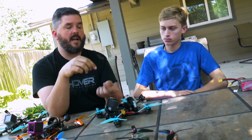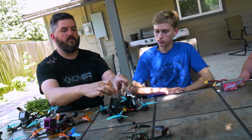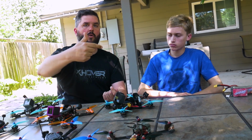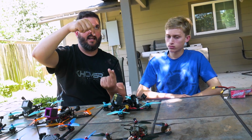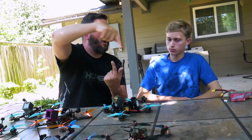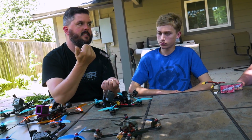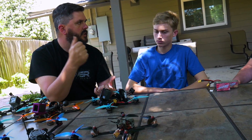So with a True-X, there are so many trade-offs. With a True-X and a top mount battery, now you've elongated it. Or you have a True-X with a bottom mount battery, and both roll and pitch, because everything is centered around yaw, right? But with roll and pitch, now they both are fighting the same amount of weight distribution. You see what I'm saying?